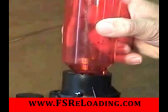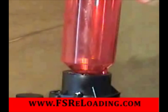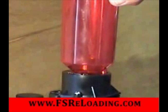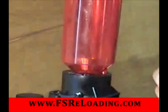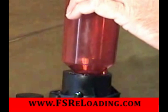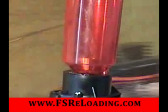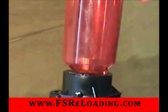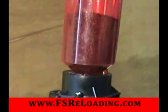Reinstall the hopper so that there is an unobstructed view of the drop tube hole, and secure the 2 brass thumb nuts. Fill the hopper with the correct type of powder and be certain to rotate the hopper to the on position.